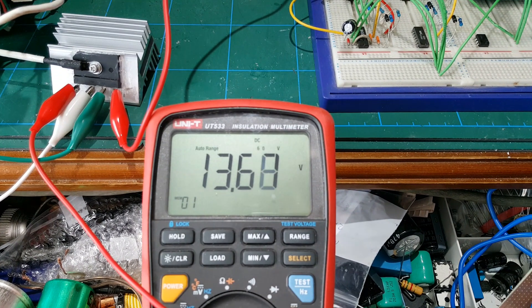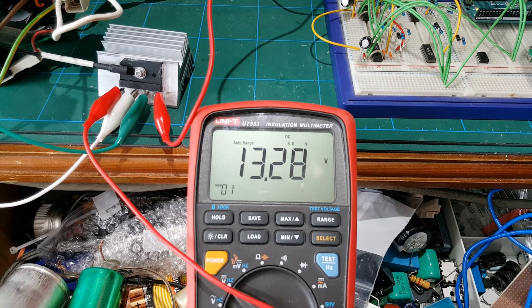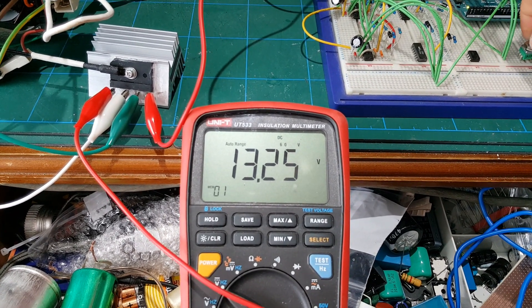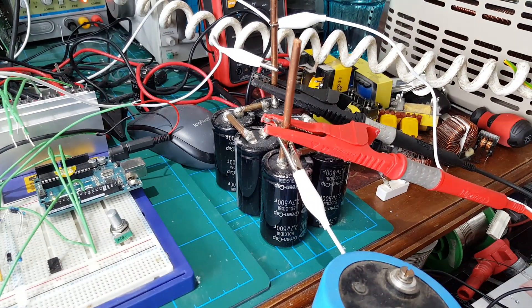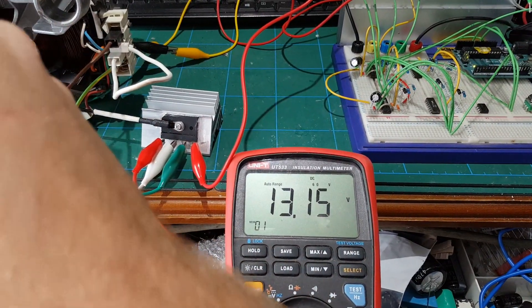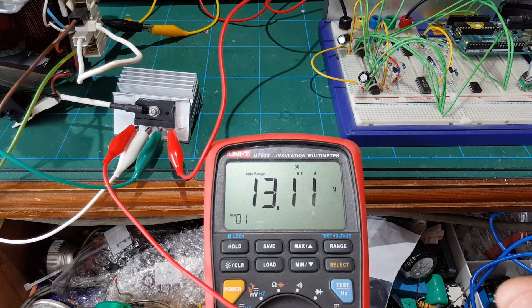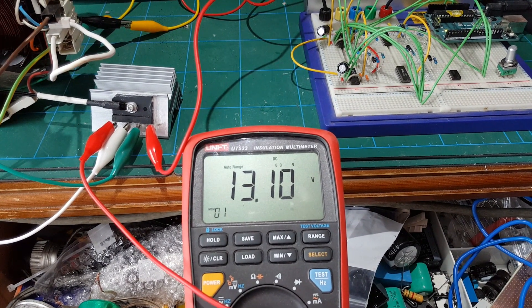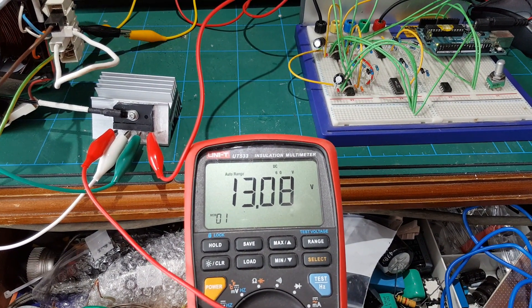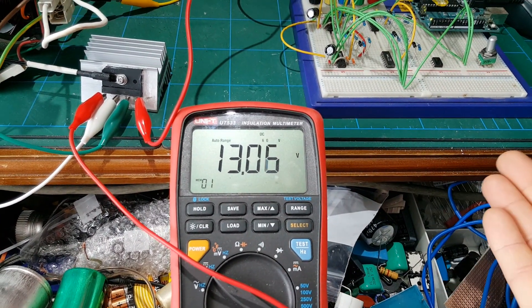Let's say we're finished rolling down the hill. We're finished charging. Now, don't forget — although this motor was generating 60 volts, I've chosen a 16 volt supercap bank. You need that to generate the force. If we had a 60 volt battery and a 60 volt motor, it's going to reach an equilibrium before you've even started, so it's not going to pump anything into a 60 volt battery pack or capacitor bank. So it needs to be low voltage.